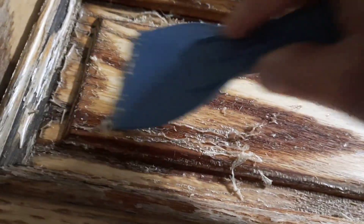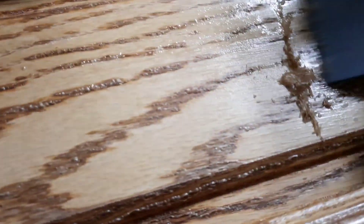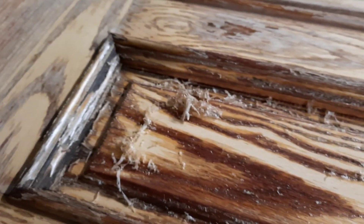A lot of that really absorbs into the wood, so we'll go with the grain. That looks pretty good. The middle section is a little tougher — I think we're going to add some more because I don't think we're getting complete removal. This trim area here is a little more challenging to get that off. So we're going to add a little bit more stripper where it's kind of dry, and then we'll complete this panel.